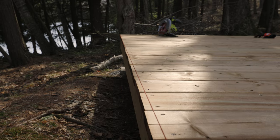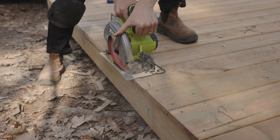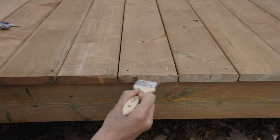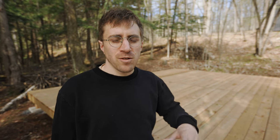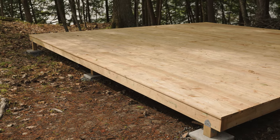This next step is bonus — there are minor differences between the deck board lengths, so just a quick pass with the saw and some sealant on the ends makes it look a little better. I'm really happy with the way this turned out. It's a little spongy, and if I could build it again I'd maybe use 2x8 or 2x10 framing material or just make more footings. You can forgive a little bit of bounce — it's a tent platform and it's going to work great.